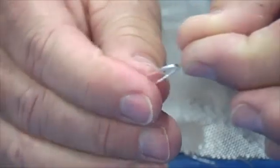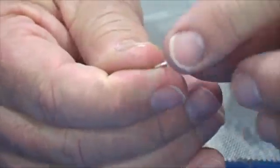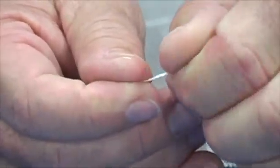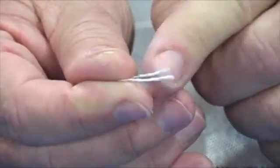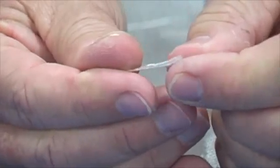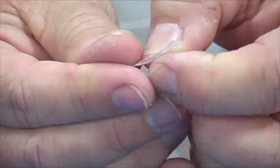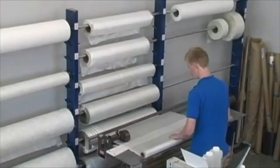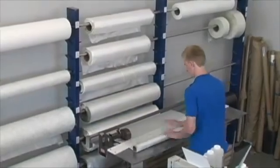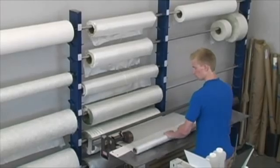We can demonstrate that this is glass with this thread. Glass is very strong when pulled, but glass does not like to bend. So when we fold the piece like this and twist it, all the fibers break. That is why you never want to buy folded pieces of fiberglass. Tap Plastics always rolls the material on a tube and cuts it to your desired length.